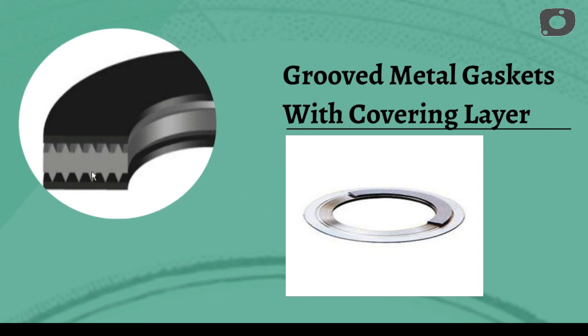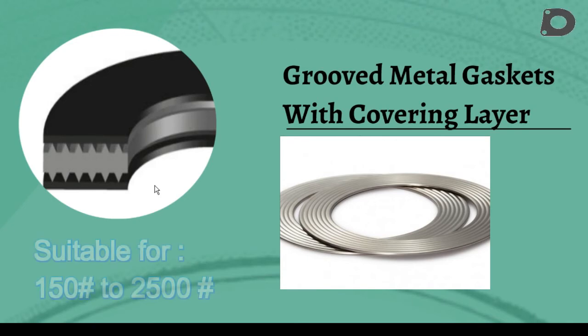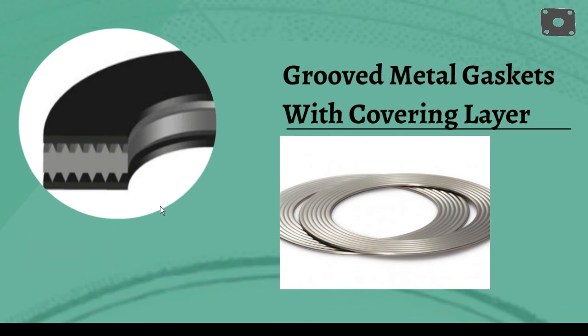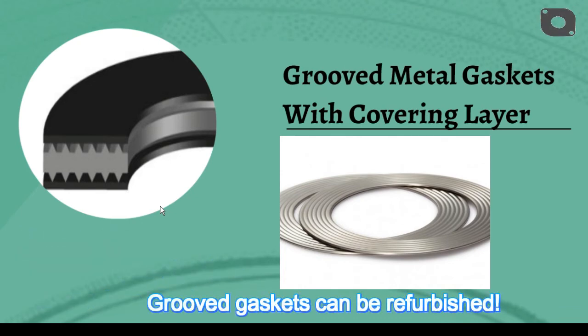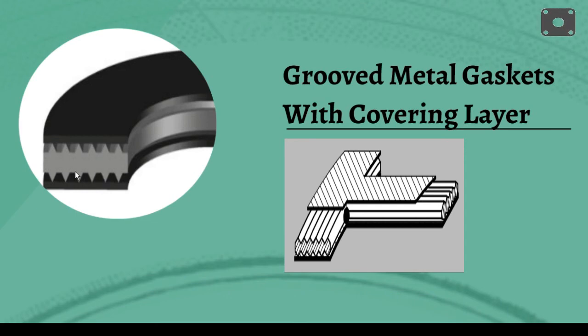Size-wise, grooved gaskets can be manufactured in a wide range of sizes, from a few millimeters to a diameter of 3,600 millimeters. These gaskets are suitable for use in Class 150 to 2,500 service and hence can resist pressures of up to 350 bar and temperatures of up to 800 degrees Celsius, depending on the sealing material type. Some of the advantages of grooved gaskets are: depending on the metal core, the gaskets can be refurbished, the only type of gaskets that can be used again after having been refurbished.